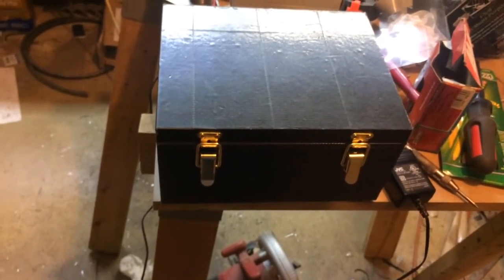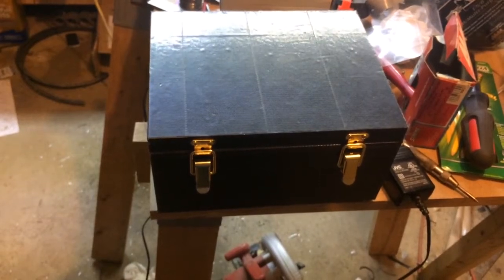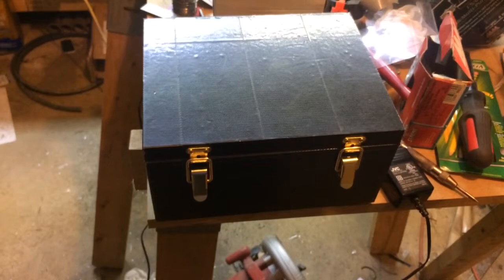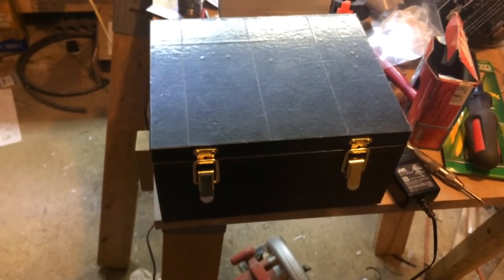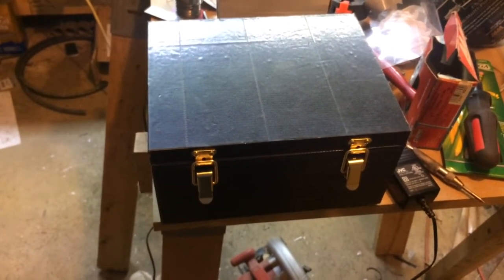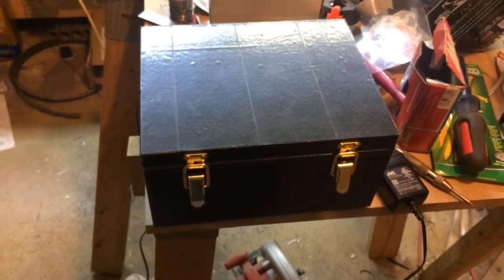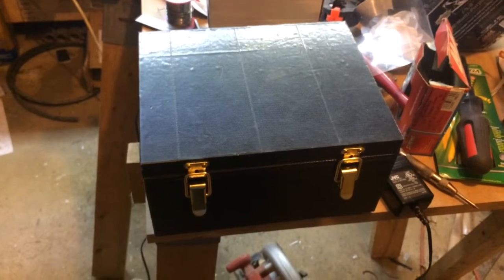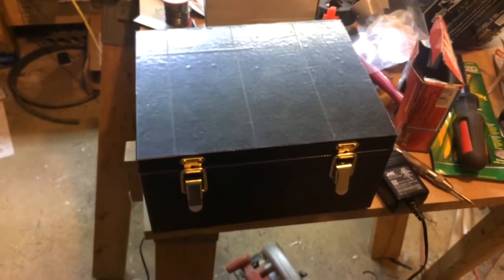And that's not really the case with PCB film. It's actually intended to be laminated onto a copper clad circuit board. And because it becomes laminated on there, it doesn't really fall apart like it would if it were floating around like a regular stencil. And then you could put acid or whatever on it, and then strip it off with a purpose-made cleaner.